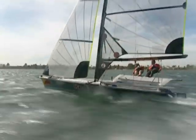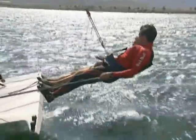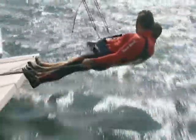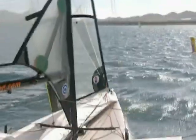Once the main is more than six inches off the centre line, or if the windward shroud goes loose, then it's time for a rig change. OK Peter, shrouds are too loose, I'm going to have to go for a rig change.